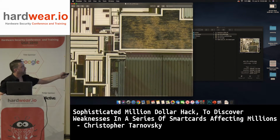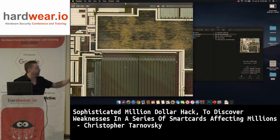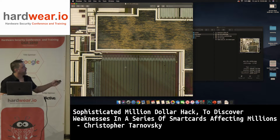Once you do all this work in that boot ROM, and this had a shield, by the way, the shield went diagonally across the chip. Again, another case in point, the shield didn't work, so I just made holes in the shield. No big deal. But then I saw the same thing again: randomness where it would just stop talking to me. And when you're in a 5-hour or 4-hour FIB edit, if you rent the machine, it's $350 an hour. So you honestly have to own the machine to handle these jobs.